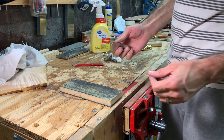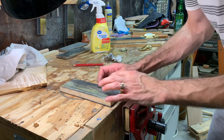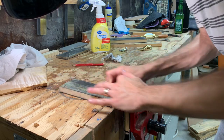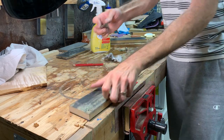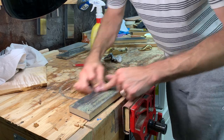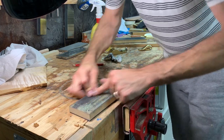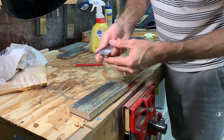This one is just a piece of MDF with that same honing compound on it — there's no leather on this one so that it stays nice and flat, and that's what I work my backs with on my chisels when I'm polishing up the backs after polishing the bevel. I'm holding both corners and putting one more finger right on the bevel there.